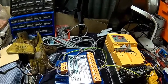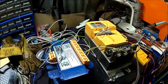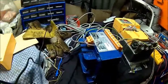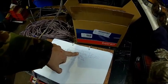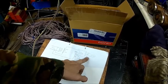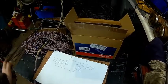Sorry, the fan is a bit loud. There may be some noise on the audio because I'm charging at the moment, and we might pick up some transformer noise as well. Anyway, again the setup is pretty simple: we feed in 440 volts, we told the inverter to make 400 volts at 50 hertz on the output — the nominal UK voltage — and any machine will run on that.